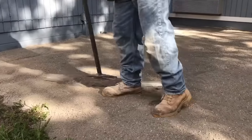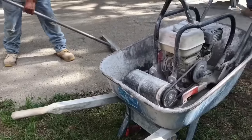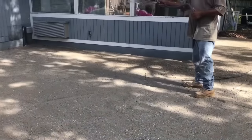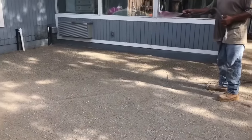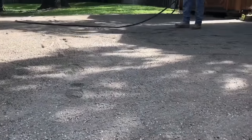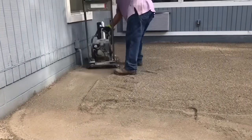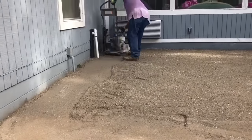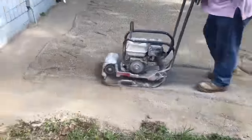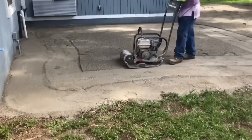This is a landscape rake, and there is a subtle nuance to this — there's kind of an art form to it. They're grading the paver base with a one-inch-for-every-10-feet slope away from the house and into the heaviest part of the yard. You can't even tell by eye, but they did a great job. During the last rainstorm I noticed the drainage was absolutely perfect. After a quick spritz, it's time to compact the paver base into the ground. A 14-inch-wide compactor is doing quick work of this job — you can do it by hand, but this machine makes it much faster. 3,000 PSI all the way to the ground.